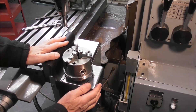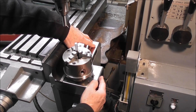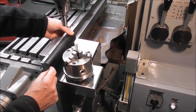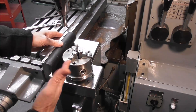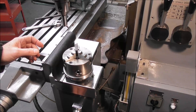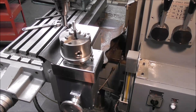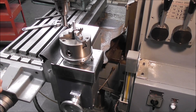Every aspect of this development took quite a bit of time — this is about the fourth iteration of guards or covers. You can see these are metal guards that protect the internal mechanism from swarf or chips. I had to have a flexible system for the vertical slide that allows covering the slideway in the various positions. I'll just wind it right up now and show you it operating.